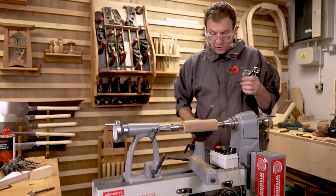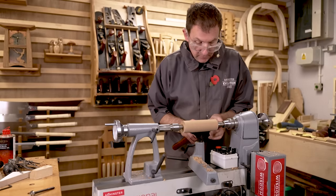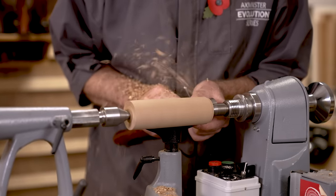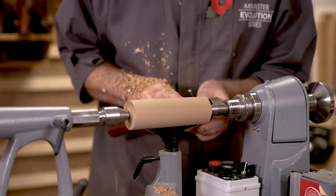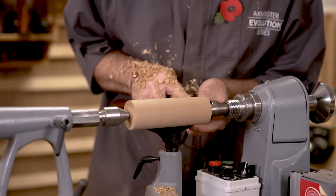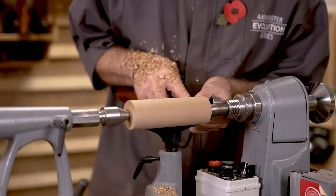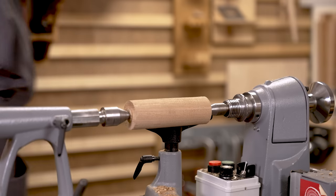So headstock in, which is where we've got that bolt. Bring my speed up. Faster speed will make it easier to cut. 3/8 spindle gouge. Handle low as we start. Gently come up. Come in, getting nearer. Start to measure it. Bit to go yet. I know my ring drive is less than 20. Bit to go. Ooh, that's good. So we want to get that shoulder. I'll just grab the board back.